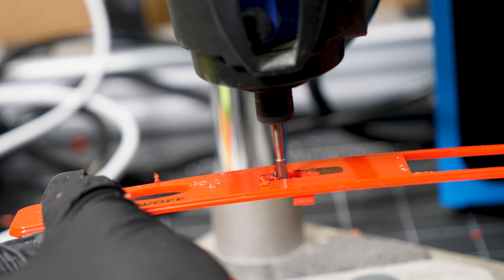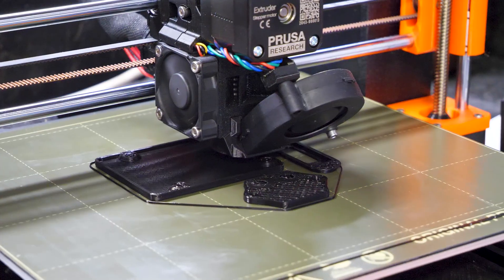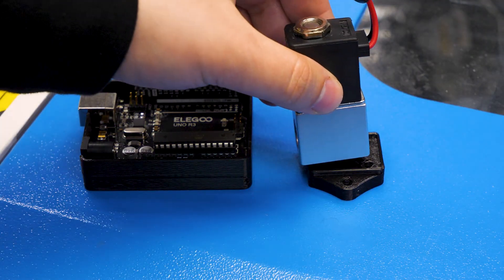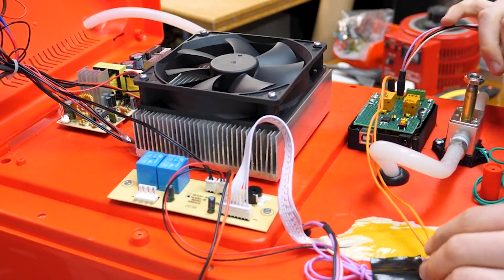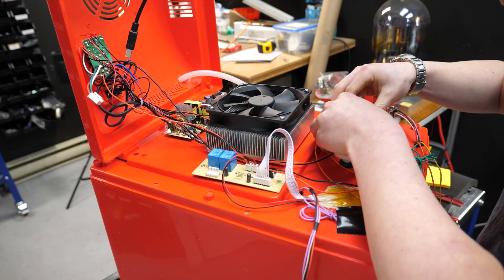To fit the LCD onto the front cover, we popped the front panel cover off and then used a Dremel to mill a slot. We also drilled a hole for the power switch. For the Arduino and also for the solenoid, we 3D printed a custom box and a custom mount to make it easy to mount them to the back cavity using just a couple screws. With the main electronics mounted and wires run, things could just be plugged in and the tubing connected. In terms of electronics, we had to make a custom shield to fit on the Arduino with all the different bits and bobs. The schematic, of course, is in the description.